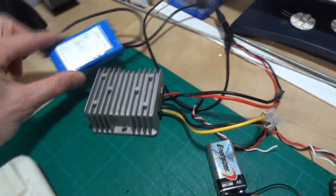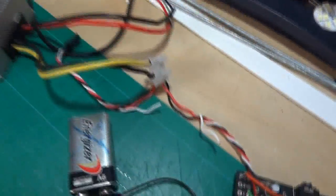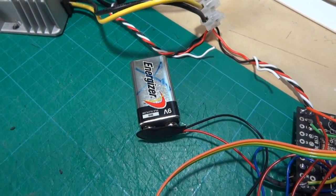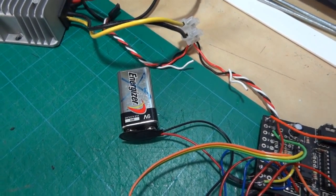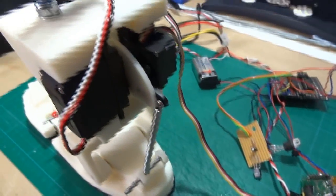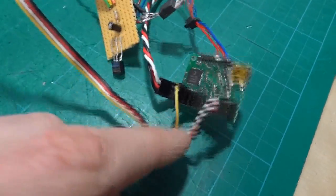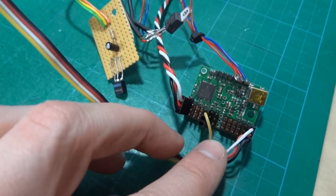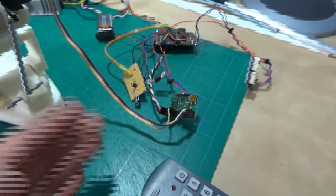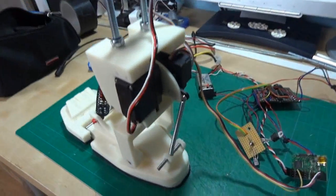I've got the power supply and battery taken from Android 11, which is a 12-volt battery and a 10-amp 5-volt regulator providing power to all the servos, and a small 9-volt battery powering the electronics. At the moment I've got a program which feeds a fixed position to the servo — it sends serial data to the servo controller and tells the servo to go to a fixed position. With the remote I can activate another program which changes the sensitivity of the gyro. These gyros have an extra cable; I've got two channels of the servo controller — one is power, one is the servo signal, and the third is the gyro sensitivity which you can set with another servo channel.